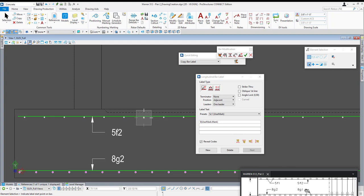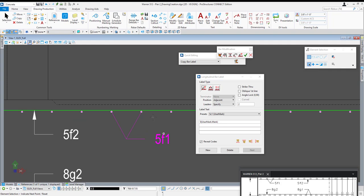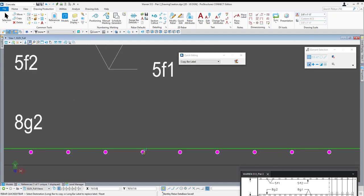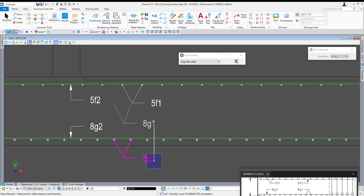Position adjacent gives us text right next to the leader line. For leaders, I'm going to specify 2. Then I click in between whichever two bars I want a leader to go to, left click once to place a vertex, and then pull in a direction and right click to place my callout — or continue placing midpoints along this vertex. There are orientations where the program will add additional formatting. With that set, I'll accept and then use copy bar label again on the 5F1 and select my bottom longitudinals and transverse. After those have been copied I'll select that callout and move it up. That looks good.